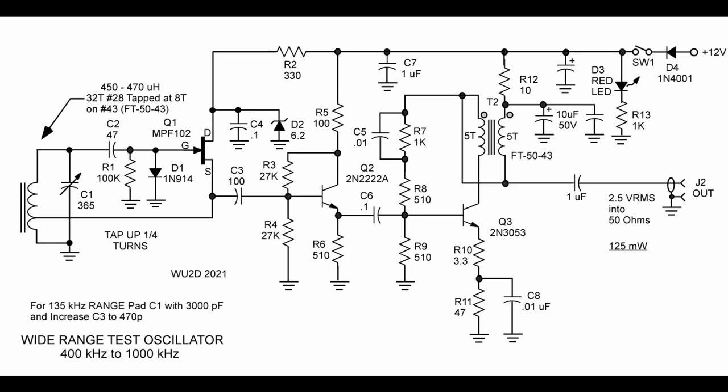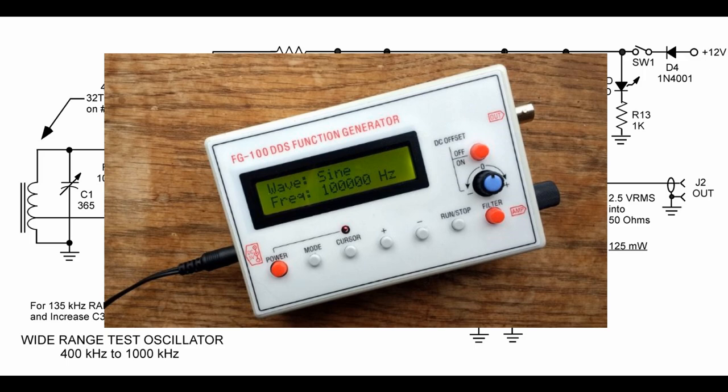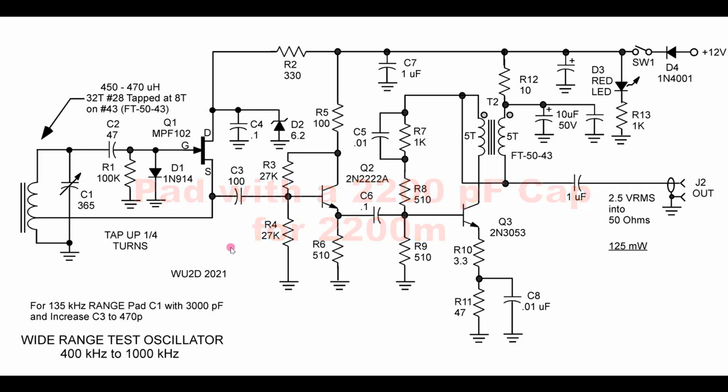Any source with enough output to be detected by the diode in a test bridge and drive a meter will work as a test generator — an old bench RF generator, or better yet a DDS direct digital synthesizer with a frequency readout is ideal. But I wanted a simple portable analog job, so I built this little wide-range oscillator. It's a simple JFET Hartley oscillator with a buffer stage — an emitter follower — and an output stage, a 3053, which can drive quite a bit of power. With a padder cap you could use this down on 137 kHz on the 2200-meter band. If you don't have a 3053, try a 2N2222 or two of them in parallel in the output.